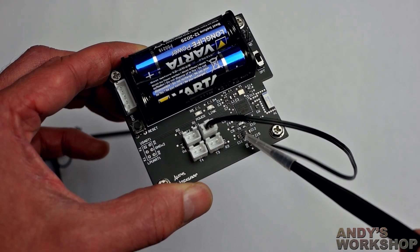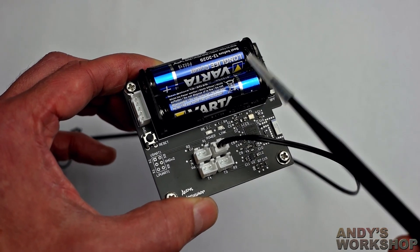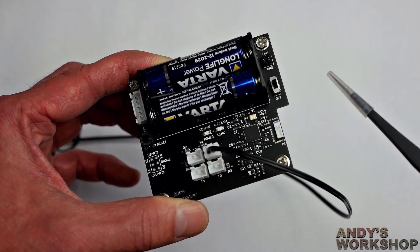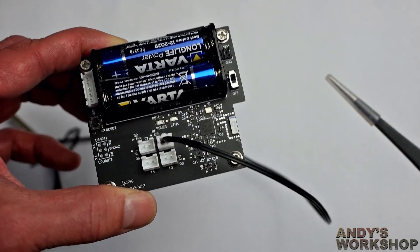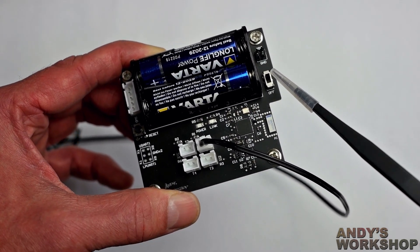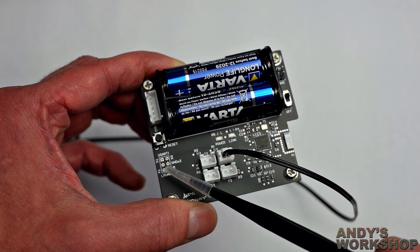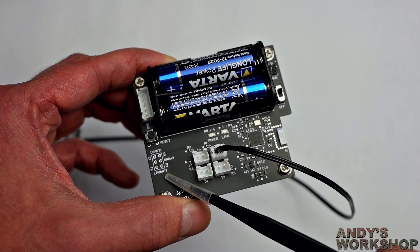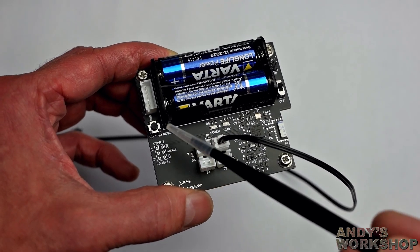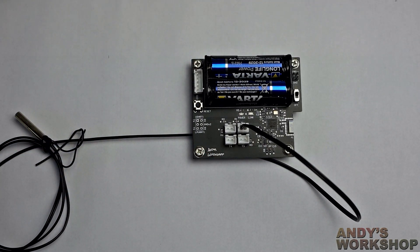Given that's a 1.8 volt reference, that gives me a lower level for the battery volts — it can't drop below 1.8 and still work. Other features of this board: this is my second version of it, a bit better than the first one where a lot of stuff didn't work. I've got external power input facility here, you can switch the whole thing on and off with a switch, a debugging connection, debug UART output, and LP UART 1 output if you need to do debugging for the wireless stuff because the ST stack has that built in. And an external reset button. The device is powered up and if you watch keenly, every 10 seconds the power light flashes there — just to show that it's alive.